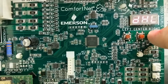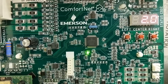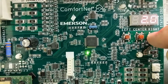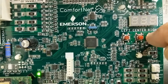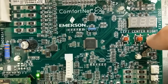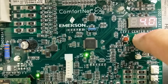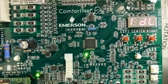Now we keep scrolling to find TON. We select that — this unit defaults to 6.0 since it's been set up before as a demonstration unit. We scroll up in 0.1 increments to set it to 4.0 for a four-ton unit, then press the center button to confirm. We're back to TON. Hit any two buttons — left and center — and we're back to idle.